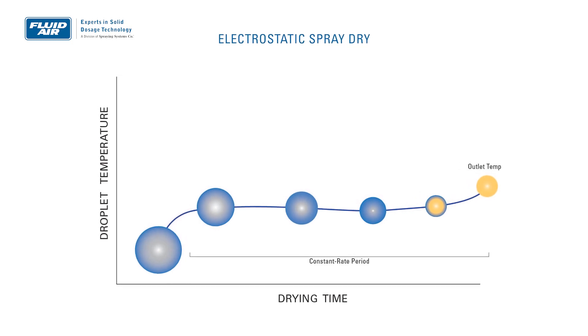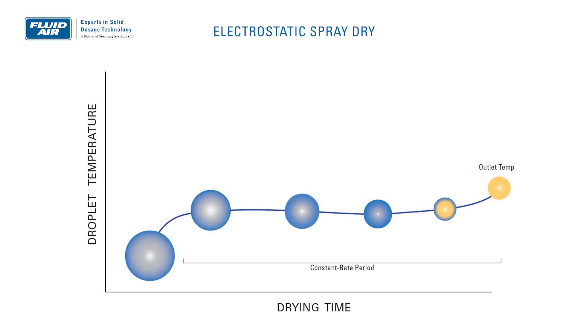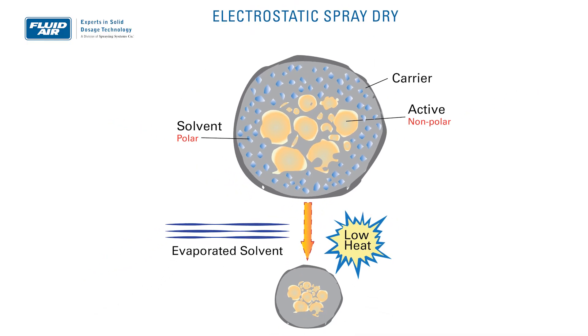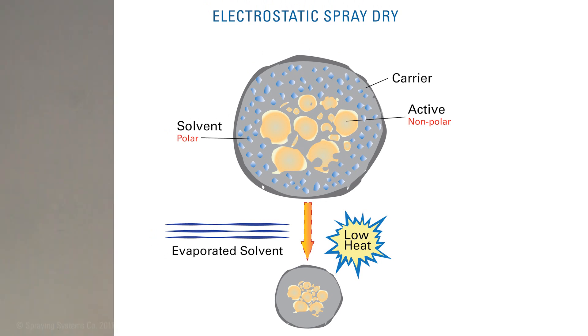Because we are able to, in a polar dry, stratify those components, we are not getting a shell formation. So you can prolong the latent heating phase. Of course, there's going to be some sensible heating at the end, but we are able to dry without relying on sensible heating to remove residual moisture.